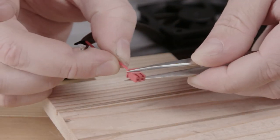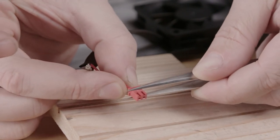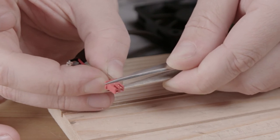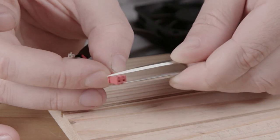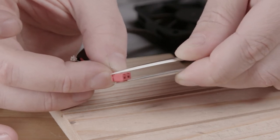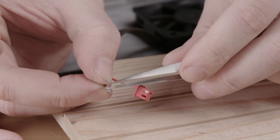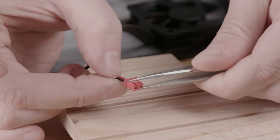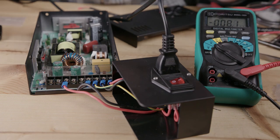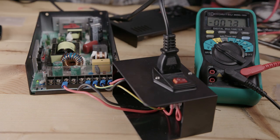Okay, so just carefully slide the connector pin back inside. You shouldn't need too much force or anything. It's going to just kind of pop in, and you're going to hear it pop in. And then it shouldn't pull out again after, if you've lifted this tab up a little bit. I'm just going to put the trim pot back into position at 24 volts.